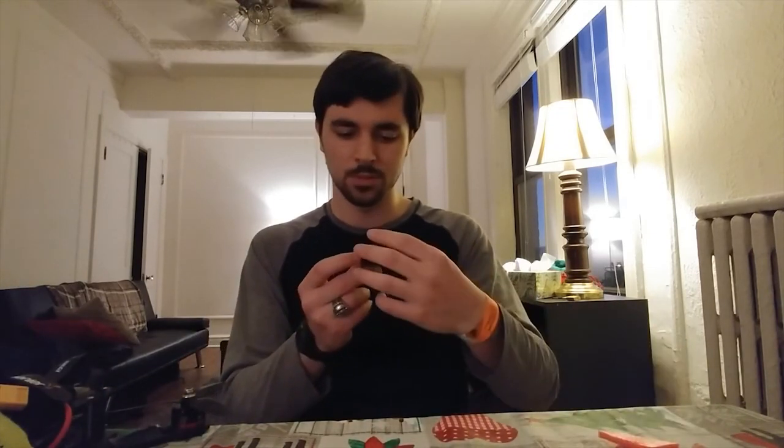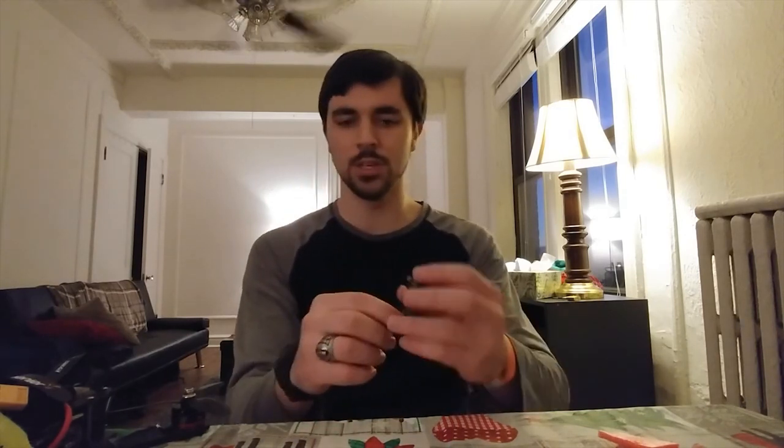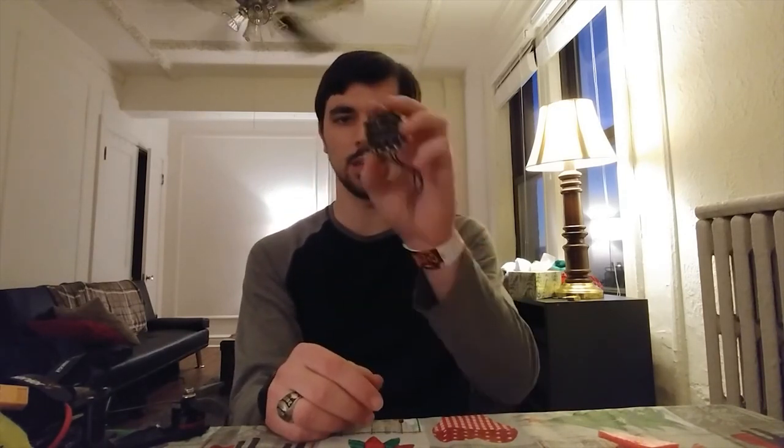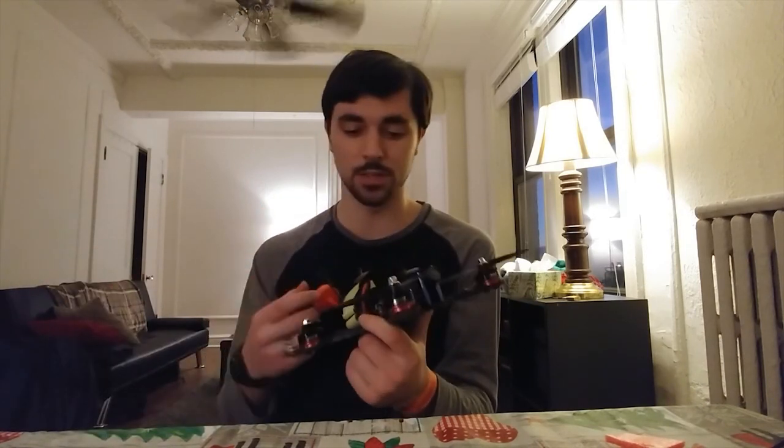These are actually the V2s, I guess. These will not accept Dshot. Just the single stack ESC like this will not accept Dshot 600. However, the 2-in-1s will take them flawlessly, as far as I can tell.